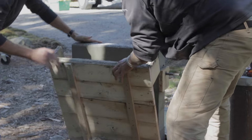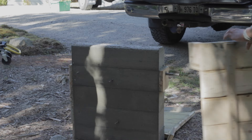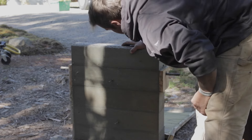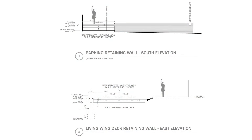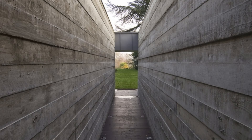You'll have to choose board orientation and width. These are fundamentally aesthetic decisions — whether vertical, horizontal, fixed or random width, broad or narrow — but they can be used to underscore a particular design vision. We chose a horizontal board which helps the site wall gesture to the horizon, reaching out into the site. We chose a fixed width of six inches, which is a comfortable human scale proportion. Six inches also allowed our coursing to easily correlate with other elements of the architecture like the deck, our lighting, and the interior and exterior steps. Vertical boards will tend to make elements feel taller, while narrower board widths will accentuate directionality even more, making vertical orientations seem taller and horizontal ones seem longer.